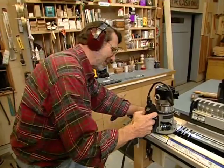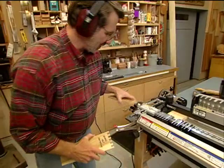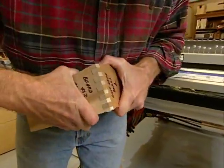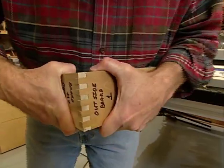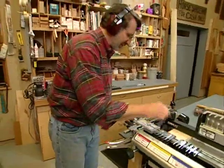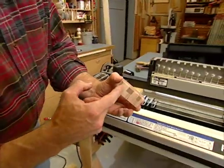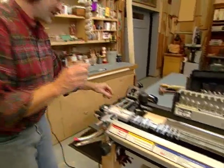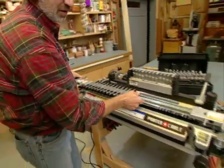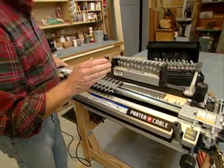Okay, let's see how we did. Take out board number two. Here's board number one. Let's see how those fit together. That looks pretty good. Now if you want to do variable spacing, you simply adjust the fingers, and the joint might look something like this. If you want to make full size or large box joints, you can use the template that comes with the 24 inch OmniJig, as well as an accessory box joint kit.